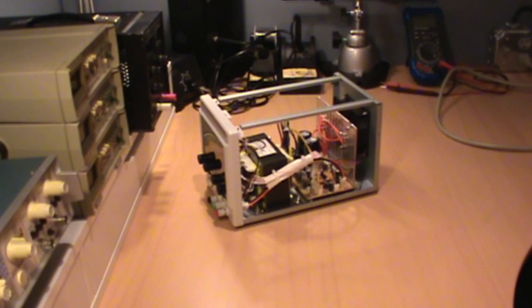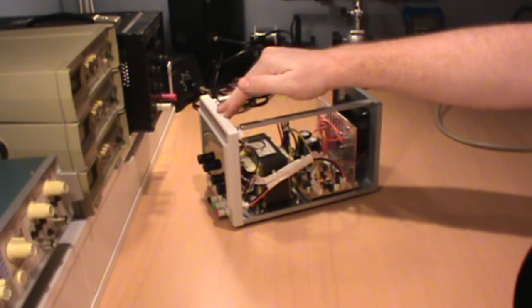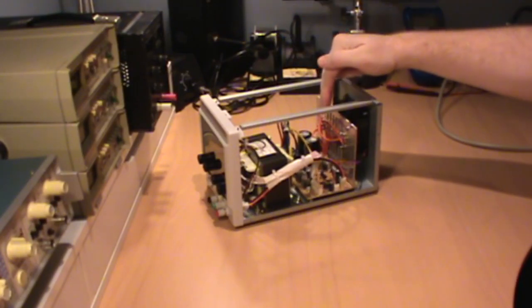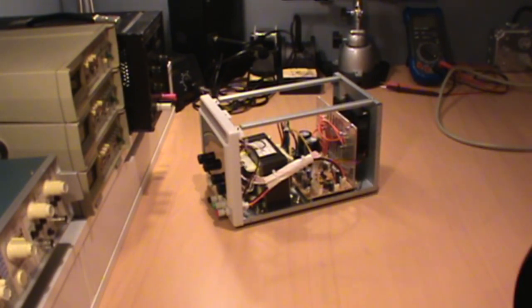Okay, upon first look, this is a relatively simple and straightforward power supply design. Standard multi-tap transformer in the center. We have display circuitry in the front handling the control mechanism. And we have a single-sided standard PCB with non-surface mount, through-hole components. And as you can see, we're using a standard 80mm PC fan. I'm assuming this is a 12-volt design.